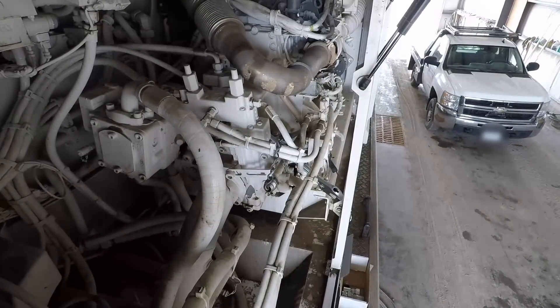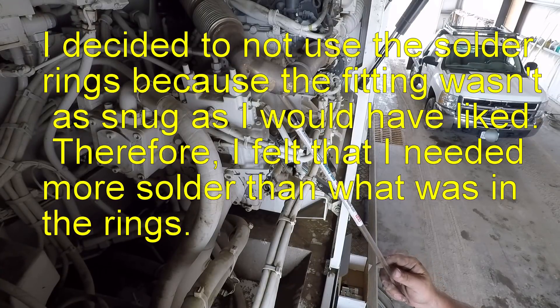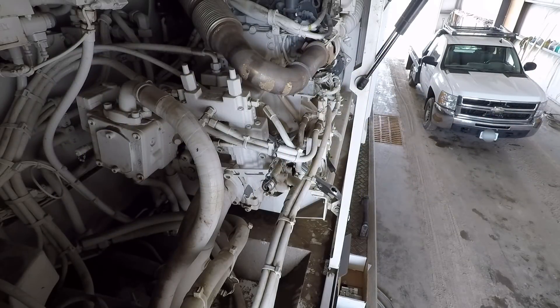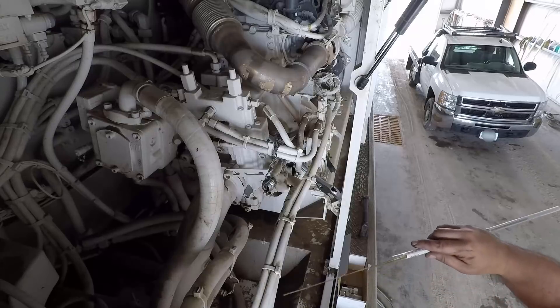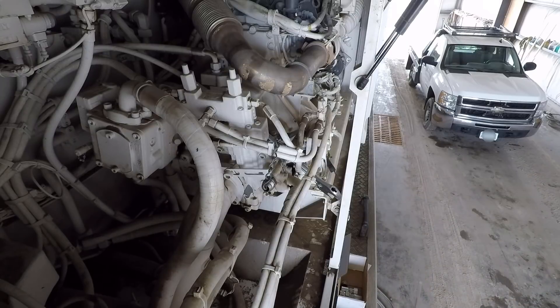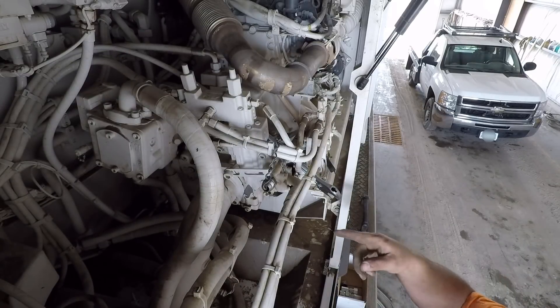It's worth a mention that what I'm using on this isn't just regular electrical solder — this is silver solder, or silver brazing alloy. Regular electrical solder just wouldn't be enough to hold under pressure. Also, since we're throwing some heat into the mix, this stuff melts at a hotter temperature, so as the compressor heat builds up in that line it shouldn't affect the silver solder. You can tell it's a different mix — it's got kind of a bronzy alloy looking color to it. We also have to apply some flux. This flux etches the metal, cleans it, and prepares it to bond to the solder. I've cleaned my fittings up already and cleaned the end of the steel line.